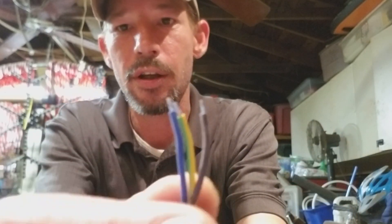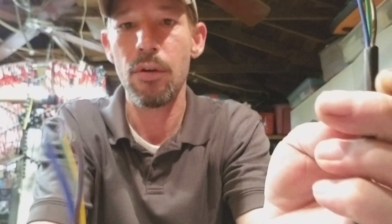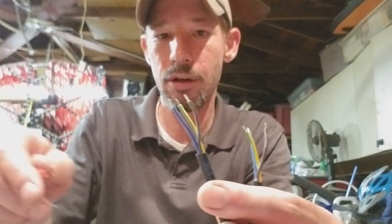Right here I've got a couple sets of pigtails, all from the same vendor. I have this one and this one — identical. All the wire colors are the same on both of them, as you can see. But how do I actually test it? There are three wires: brown, yellow, and blue. On the other side it's also brown, yellow, and blue. The whole purpose is to make sure that blue goes to blue, yellow goes to yellow, and brown goes to brown, because internal wiring — however you set it up — is all that matters.